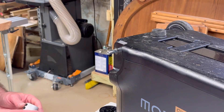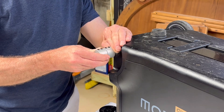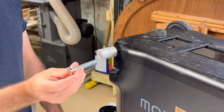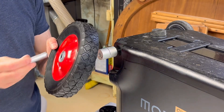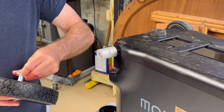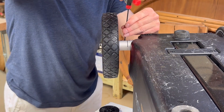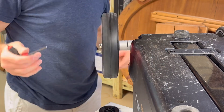Assembly is pretty simple. Take the coupling with the 12-millimeter side and mount it onto the shaft, putting it about halfway on, then snug down the screws. I've already put the push cap on the end of the 3-inch half-inch steel rod — that just makes setting the spacing easier. Push the rod through the wheel, put the nylon washer on to keep the wheel from rubbing against the coupling, then slide it into the coupling and tighten down the rest of the screws.